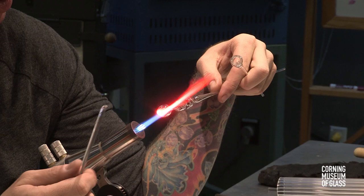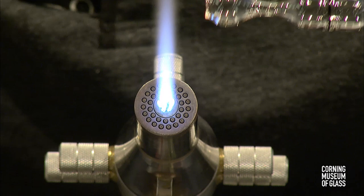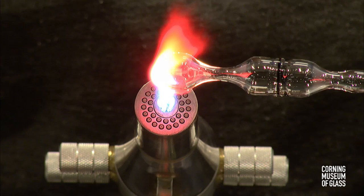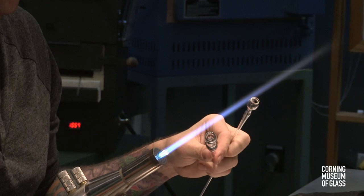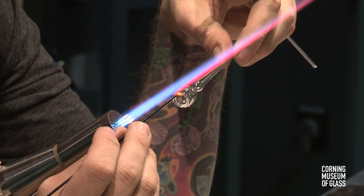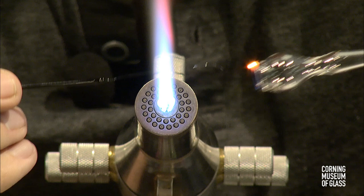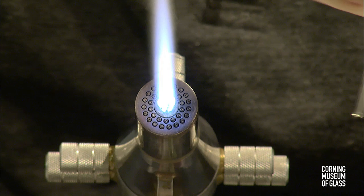And when you connect holes this small and blow them out to something much larger, that 10% you would have gained with using shears is, you really can't see it. Small flame, right on the edge. A little tap. Plug up the other end.